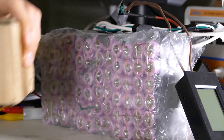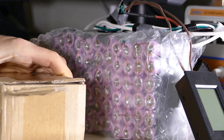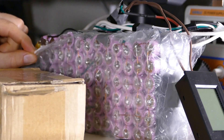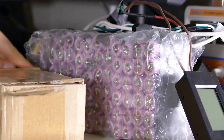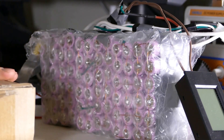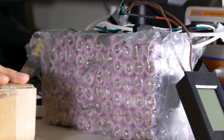I want to check the charging on those new batteries to make sure they're alright before spot welding them all together. The spot welding seemed like it went fine, so I don't think there are any disconnects at my joints — it's just odd that it won't charge past 4.04 volts. Alright, talk to you guys later.